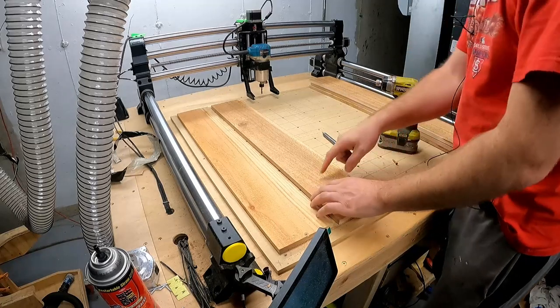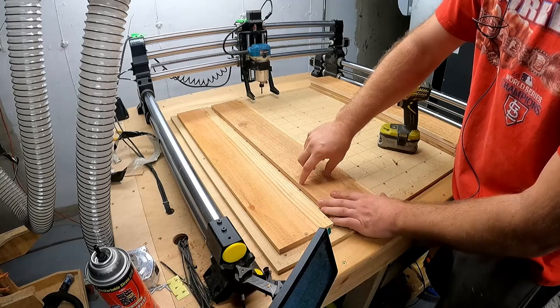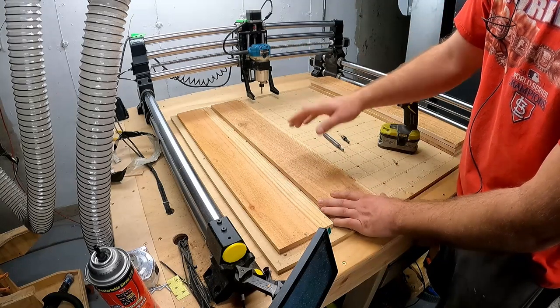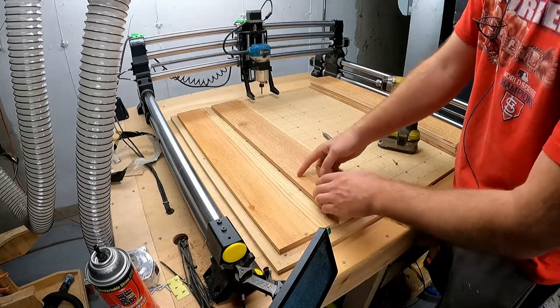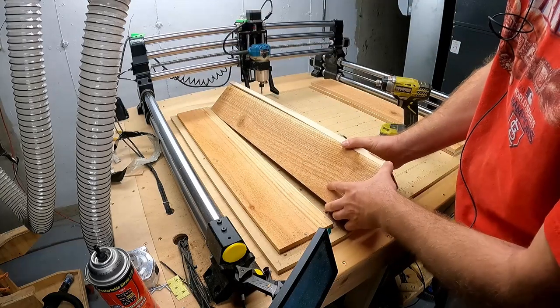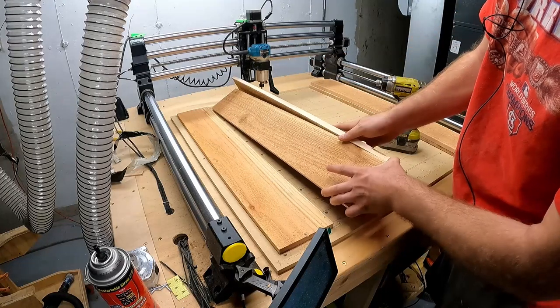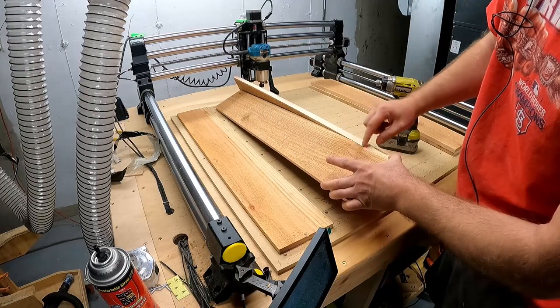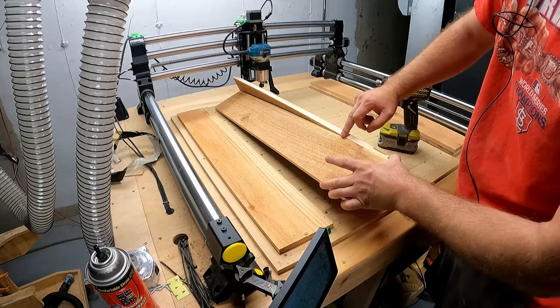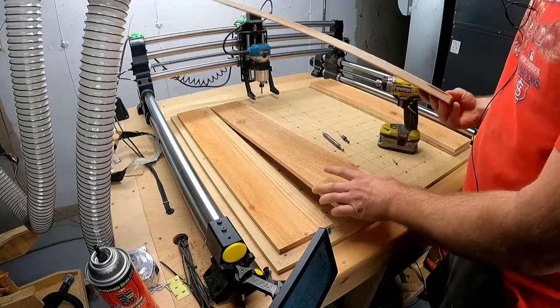Like I said, the smiles don't go out end to end on these boards. So, you know, if you're off by a 16th or something, you'll be just fine. And even if you cut to the edge, the way that I like to do these, I make the boards like this. So even if it goes out to the very edge, it'll be fine, because you have this other board that'll be your sideboard that it'll nail into. Doesn't look like anything. Unless you tell somebody you screwed up, no one will even notice.